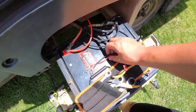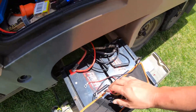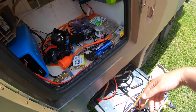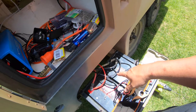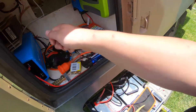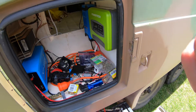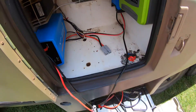The first thing I've done is remove the two leads going to the charger, leaving the big 8 gauge cables. Everything in this box, aside from the charger, will run off those two 8 gauge leads with a couple of bus bars. I've also pulled the wire back to clear a hole for the solar wire and temperature probe for the solar regulator.